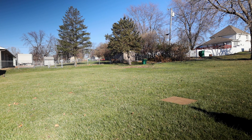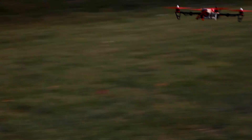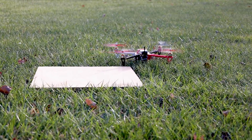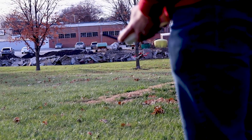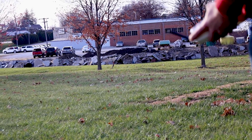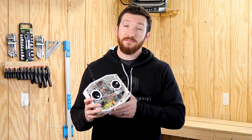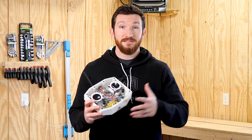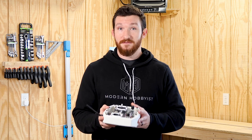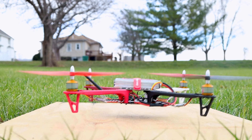This ended up being one of those projects where absolutely everything worked out as planned. I didn't make any mistakes or break anything, and pretty much everything worked out perfectly. No, obviously that's a lie. There were several things I missed during the design phase that I had to figure out and fix later on, but that's all part of the fun. Starting from the top: I made the mistake of assuming that the 3.3-volt pin on the Arduino would be enough to power the radio module without any problems. So I ordered a bunch of PCBs, soldered them up, and the drone had a range of like 10 feet. And I don't need to tell you that being within 10 feet of a drone like this is terrifying.